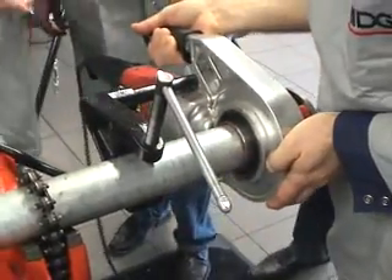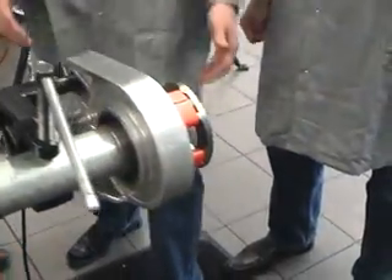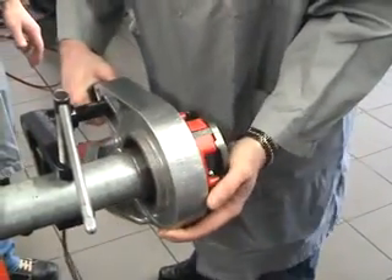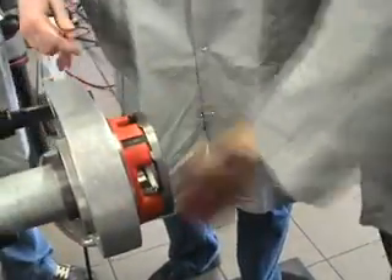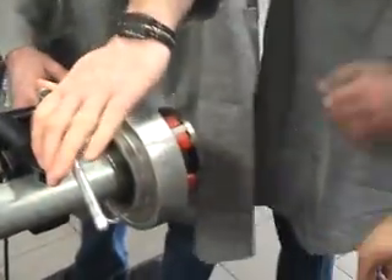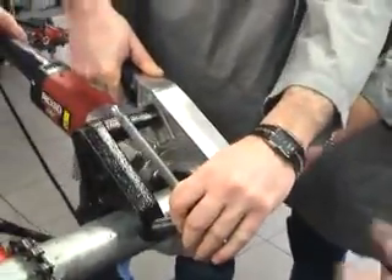First, is the position of my machine okay? No, position is not okay. It has to be higher up. Why? Because the oil drips off here, gets sucked into the air vents into the machine. After a few months, you have more oil in your machine than in your pocket. Push it up — not too much. That's it.